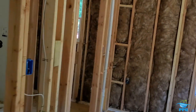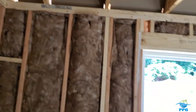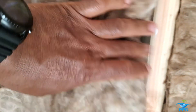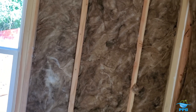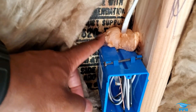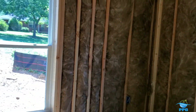I'll check to make sure that the insulation is cut and fits the cavity. I'll also check behind the outlet, because you don't want to leave a void. This bat of insulation — R-value 13 — you want it to be flush to the sheathing, as flush as possible. You want that bat to be cut and fit exactly inside that cavity. I also check for insulating behind the receptacle boxes. You don't want any voids; you want everything to be flush, nice and smooth.